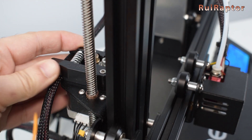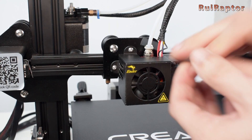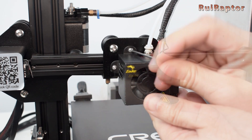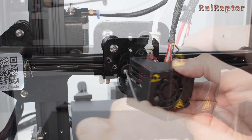Let's start with the installation. First, make sure you have no filament inserted in the printer. Turn off the printer and remove the print head cover. Try to handle the cover carefully to avoid damaging the cables.